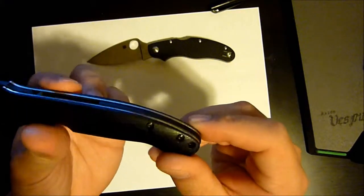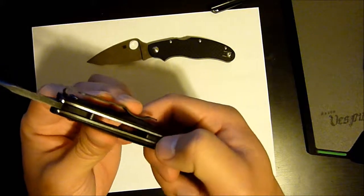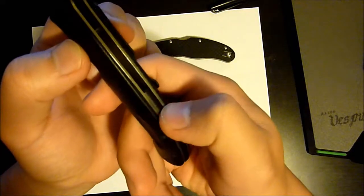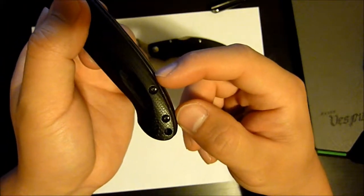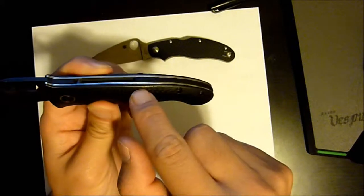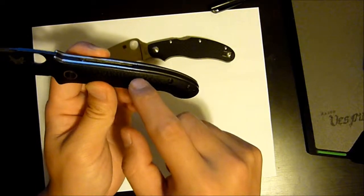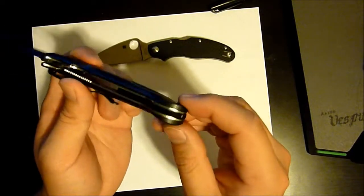The other thing is, you see the two screws here. These two screws are way back here, and there's a spacer here, and I don't know if you can see this, I can press the spacer down. It's got a bit of flex in it. So why would you use a long spacer like this? Why wouldn't you just have the spacer this long? Or if you're really worried about the strength, you have one of the screws moved up to here. That would be ideal. Right now it's a sort of half open design, but you really don't have any strength in the mid back here. So why would you have a spacer here? It's kind of weird. I just didn't like that.